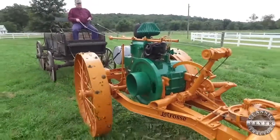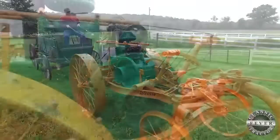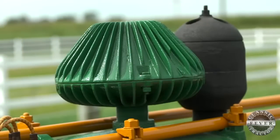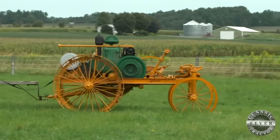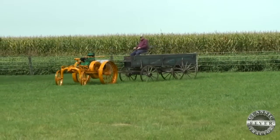The Model M is the only line drive to ever take part in the Nebraska tractor test program. The LaCrosse has a two-cylinder horizontal engine with a four-inch by six-inch bore and stroke. That strange-looking part on top is the condensing cone, which helps cool the engine and tries to save coolant. As the water evaporates, it would normally just boil off, but this cone — which looks like a Japanese lantern — condenses the steam and lets it drip back down into the reservoir where the cooling fluid is kept.